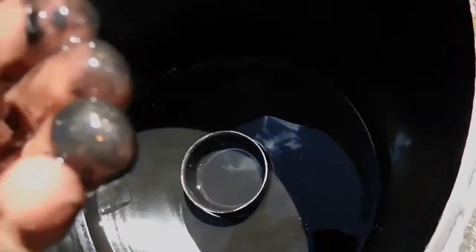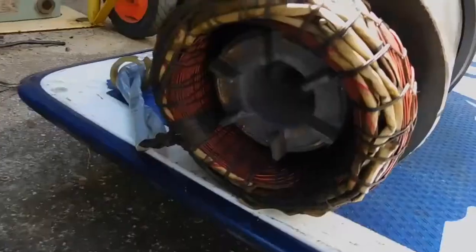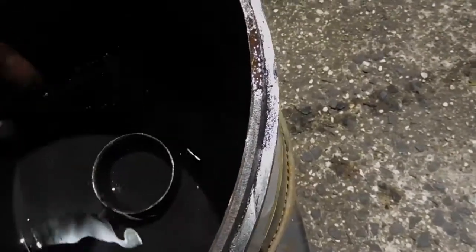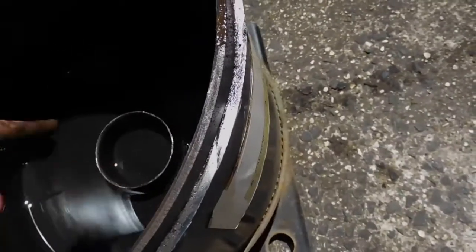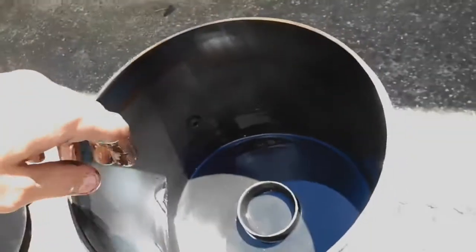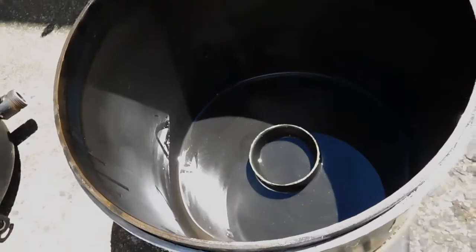There's quite a large piece here. I'm guessing she's actually thrown her rods and seized up, because I took the end off as well and the motor — you can't turn it over at all, it's seized solid. Something pretty bad is going on inside this compressor. It was all black and nasty. I was hoping to actually filter this oil and reuse it since it's mineral oil — we don't get much of that. Polyester's the horrible stuff because it absorbs moisture; mineral oil doesn't. But since it's this colour, I don't think I will.